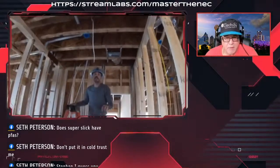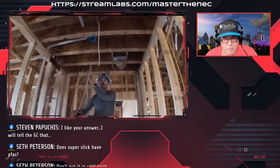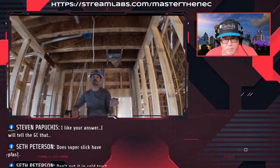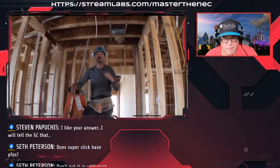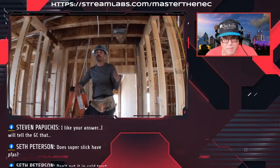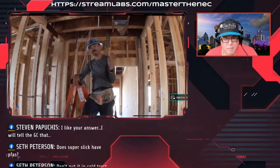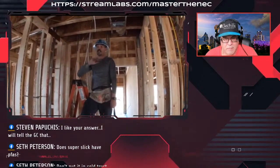Sorry. And when you're pulling through TGIs, do not drill your own holes. I mean, you can see right here, these guys that were doing the plumbing drilled their own holes. And there are certain rules that apply to drilling your own holes in TGI. But just to stay safe in code, you want to knock out the knockouts that are already there. Because if you mess up, you can fail for... I forget what it's called, but if they fail you for that, they'll have to get an engineer out here and he'll have to tell you what to do. And if they have to pull this apart and replace a TGI, you're talking a lot of money.